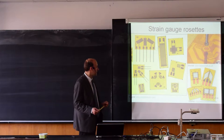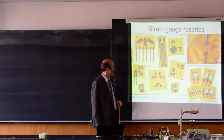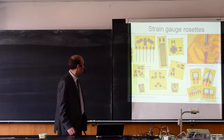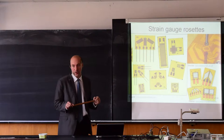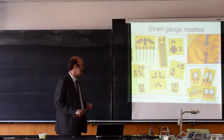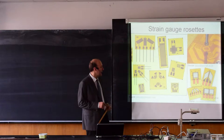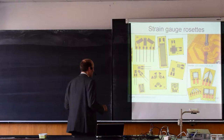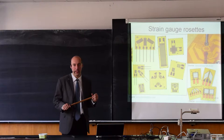You can have a strain gauge rosette with three strain gauges — for example, three under an angle of 120 degrees. From the theory of elasticity of materials, if we measure strain in three independent directions like 120 degrees apart, we can calculate the direction of the main stresses. If you have a component where you don't know the direction of the main stress, you may install a strain gauge rosette, measure the strain, and then calculate back what the directions of the main stresses are. A strain gauge does not have to be used only to measure strain caused by loading.